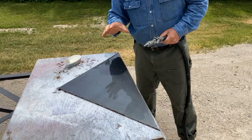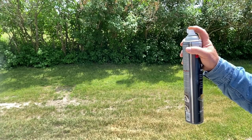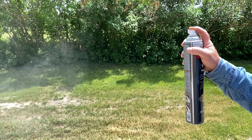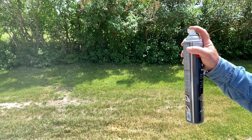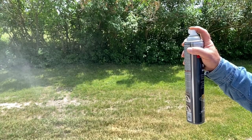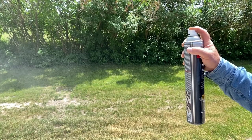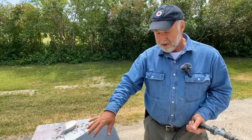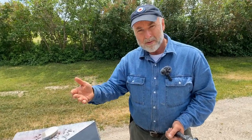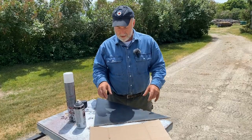When I come back I'm going to show you how wide of a spray fan that new spray paint offers. The spray comes out of a fan-shaped opening rather than a pinhole like a regular spray can, and that fan is about 10 inches wide — it's like painting with a 10-inch wide brush. You can cover a very large area much more quickly. I'll compare it to a regular spray can so you can make up your own mind and see if it makes sense for you.